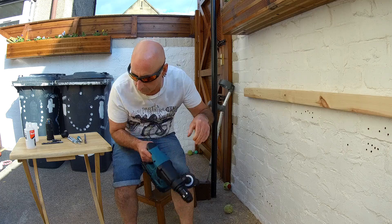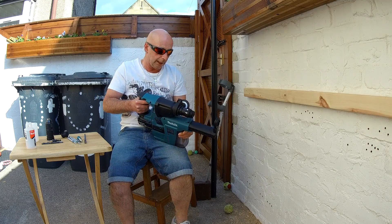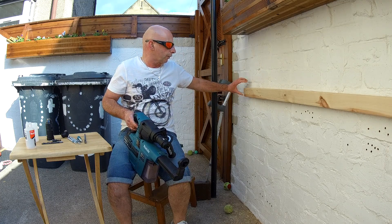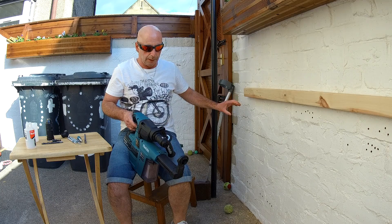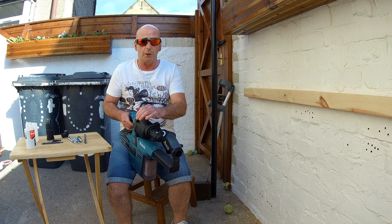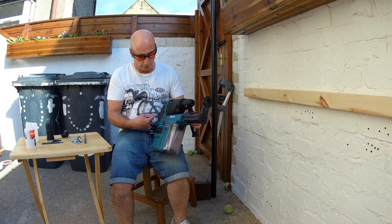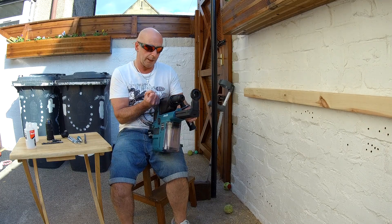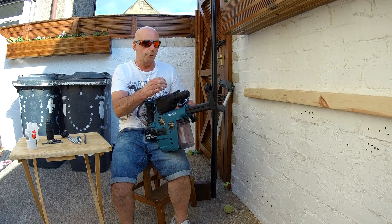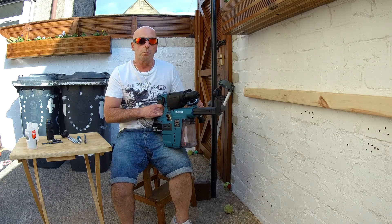So we're going to drill some holes now. What's the advantage of using a HEPA filter? It's supposed to collect dust — and I've tried it and it does. The beauty of using a rotary hammer drill SDS is it's quicker and actually has a bit more power than a standard hammer drill. A rotary hammer works by the motor turning this way and pushing the bit mechanism back and forward — there's less friction that way, so more bang for your buck.